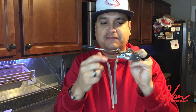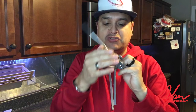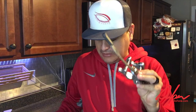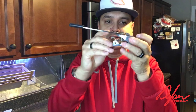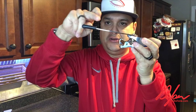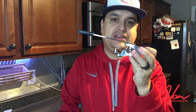Instead of swapping to a taller spring, the way I add more arm angle is to just bend the handle — bend it and put an arch into it. That gives you different leverage without changing any of the originally designed friction points, fulcrum points, or angles. The whole system is designed to work together at a specific angle, and if you change it you'll cause problems. Just bend the arm and give yourself a little more leverage instead of changing the original geometry.